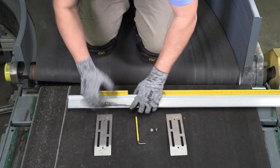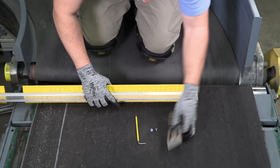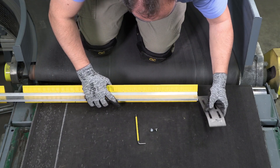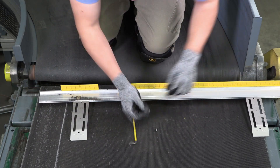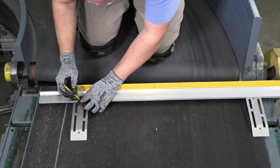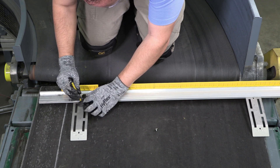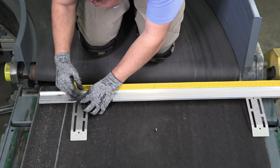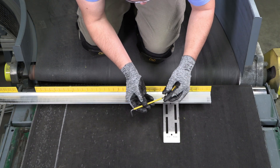Insert all the plastic segments provided on the narrow gap segmented transfer plate kit, leaving the last two aside. Insert the vertical support mount into the extruded support bar. Position the vertical support bracket into the approximate final location, no further than six inches from the end. Use the button head screws to lightly secure the vertical support bracket to the extruded support bar and place the segmented transfer plate into the transfer opening.